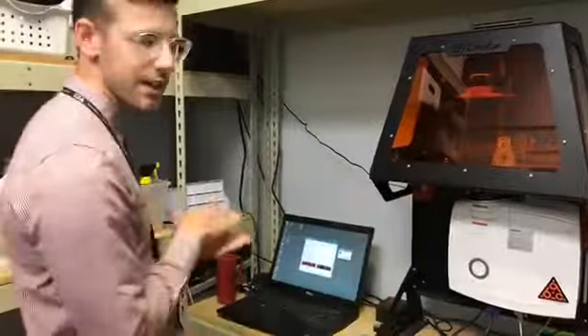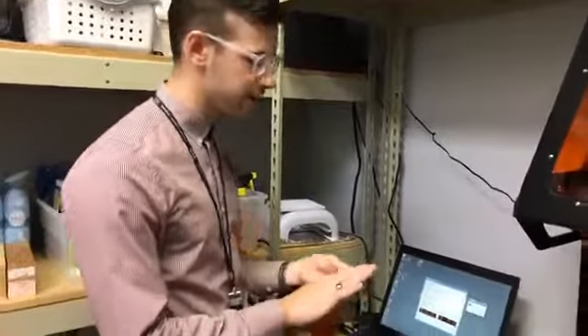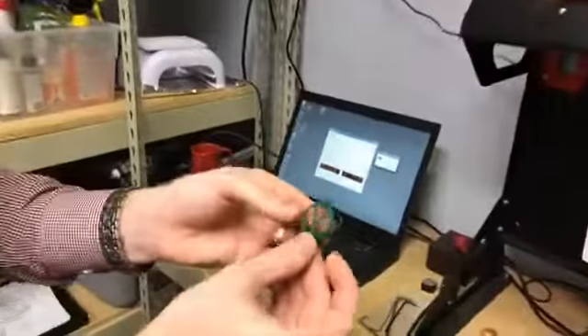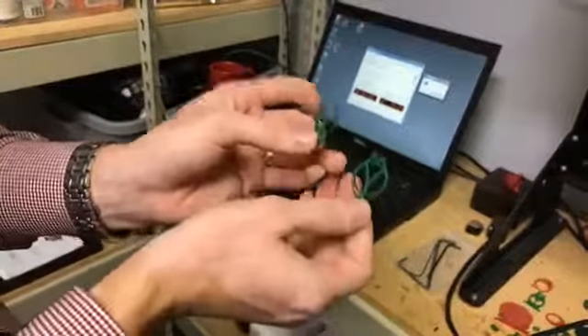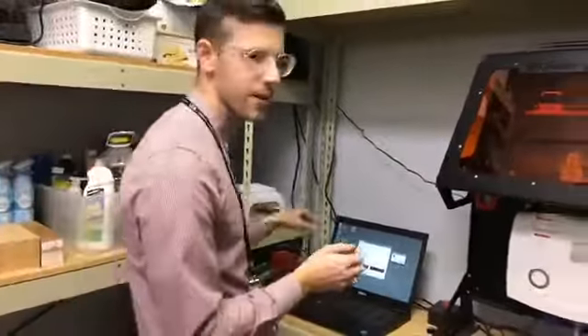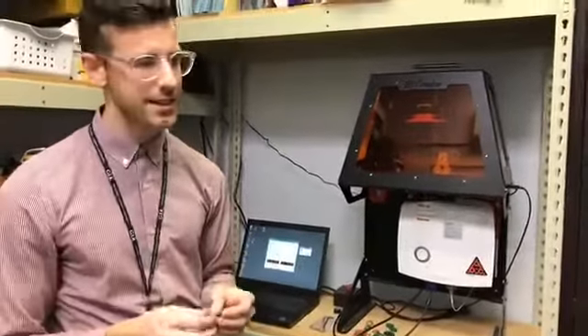After cleaning them up, we put them in our light-sensitive oven and bake them — similar to how acrylic nails are cured in a UV light oven. Here we have our wax models — this is that same custom design. You can see our sprues up in here to allow the liquid gold to flow properly. We printed them as two different pieces because one is in rose gold and one in white gold. After printing and curing in the oven, I hand them back to Haley, who will invest them and get them ready for casting.